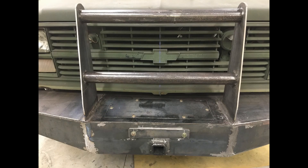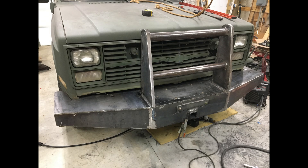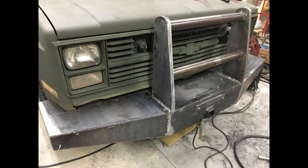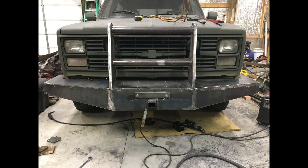After I got all this welded in it looked okay — not bad, functional — but I wanted something different. So I cut out two identical uprights, welded them in place, and used some one-inch flat bar stock — I believe it's three-sixteenths — and wrapped it and welded that in place. That makes it look a whole lot stronger and beefier; it's just more appealing to the eye.